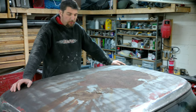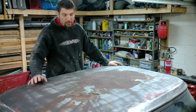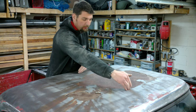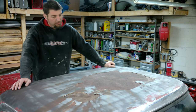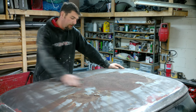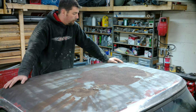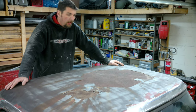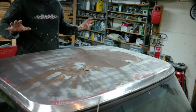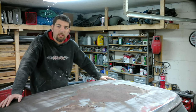They don't make a roof for this truck, so what we decided to do was butt weld some 18-gauge sheet metal with a MIG right in the center of the roof. It lasted about 15 years, but the truck's been sitting in the weeds and the filler we had on it is real rough, real bumpy, and the filler's chipping. It's just rusted out — this roof's shot now. I cleaned up the rest of the roof; this truck's pretty solid for the most part. I got a donor truck for it and we already cut and stripped that. I did that first to know where I can cut.